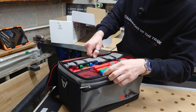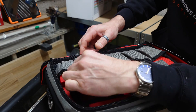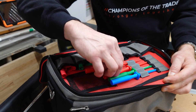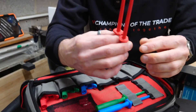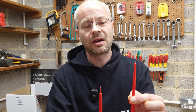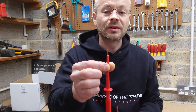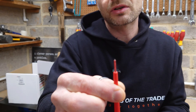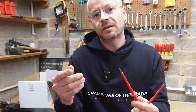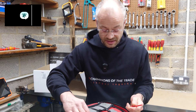Looking into this, we have your standard crocodile clips and a set of probes, of which are different sizes for the lives. That is fantastic — you can use the slightly larger one for your everyday stuff like doing light switches and double sockets. And you can use your tiny little one for little things like junction boxes where you need to test a connection which has got WAGOs or IDEALs. That tiny little probe will easily get into their test connections.